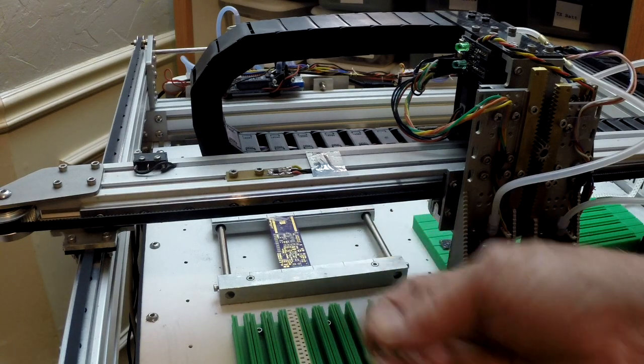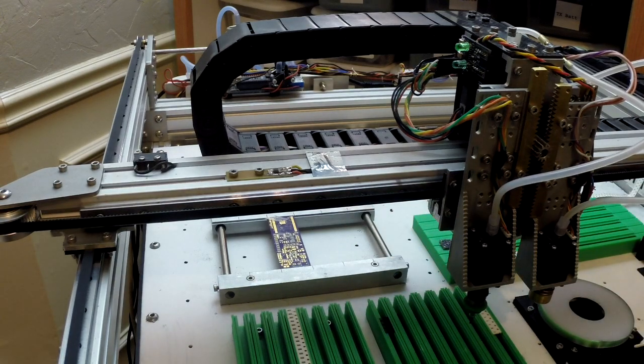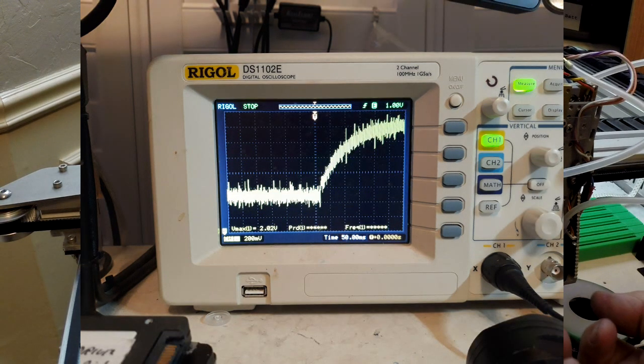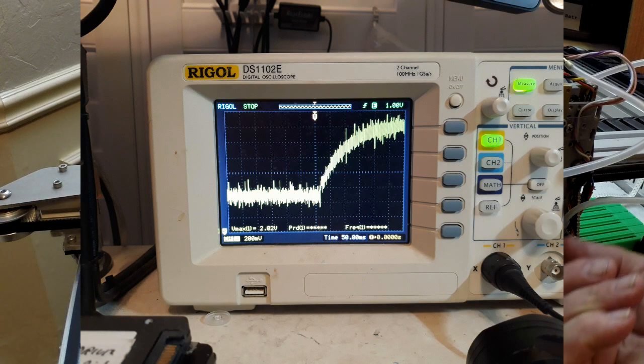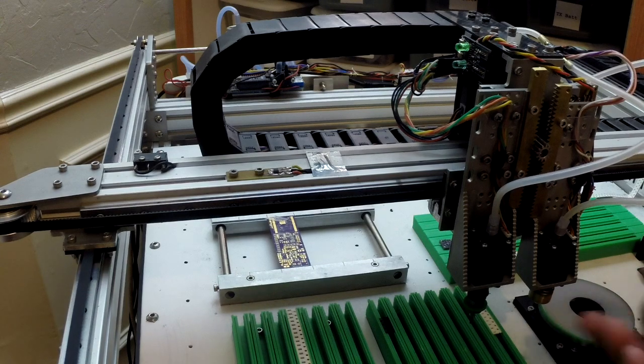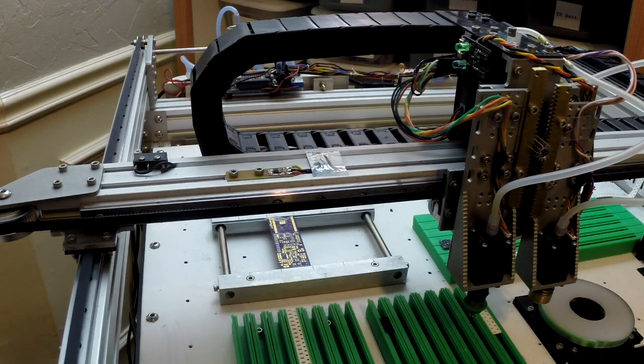Okay, so I machined this kind of stuff with an O-ring and put it on and tried it for a while. It works, but I don't know. There's just something about it. It leaked a little more than I liked. I mean, you're sucking up through the bearings on the motor. Plus these heads don't seal perfect, and I really wasn't happy with that.